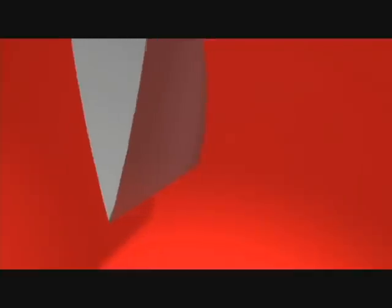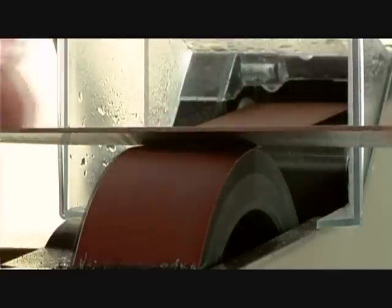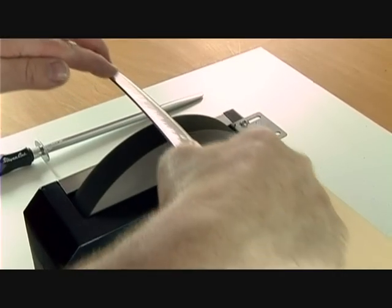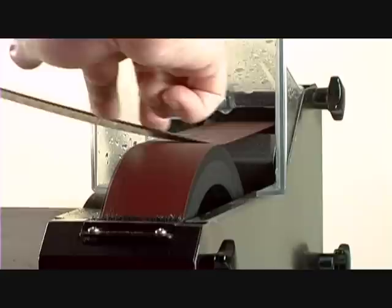The ideal way to achieve a sharp cutting edge is if the blade is ground in a slightly half-rounded shape towards the cutting edge. The technical term for this is a slightly convex grind. Knives can be sharpened using a variety of grinding methods, ranging from manual sharpening to machine grinding. The crucial factor for sharpness is the correct grinding angle.